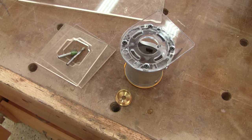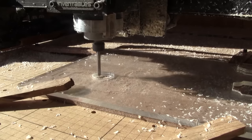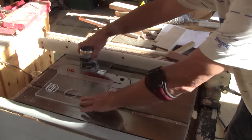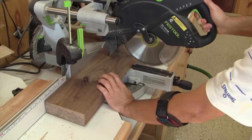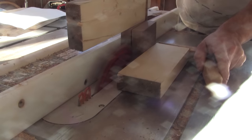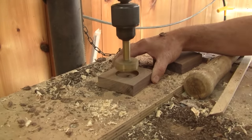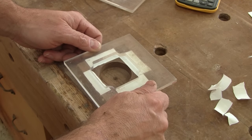My problems are not over yet. The hole of my palm router plate is too big for a collet. I bring my computer in my shop, cut a new base plate which can accept a collet, and let the X-carve take care of the rest. When it's done, I screw the router plate on the plexiglass and cut it. Then I take a nice piece of walnut and cut two blocks out of it. Then I drill a shallow hole in their middle.